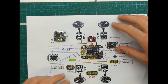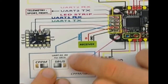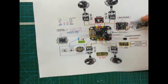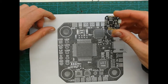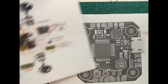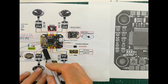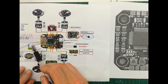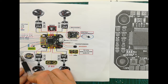Now we want to know about the other two receiver types: PPM and S-Bus. We can see them in the diagram, which leads us to the ports on the left side of the board. To better understand this, I have a large picture of this flight controller so we can see everything much more clearly. Looking at the diagram, it says 'receiver' and then lists signal, five volts, and ground.